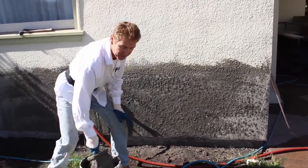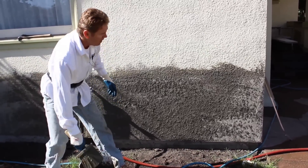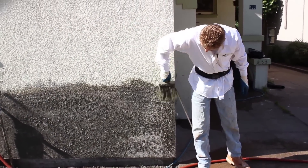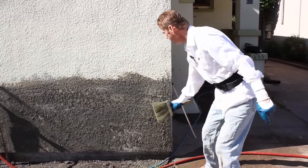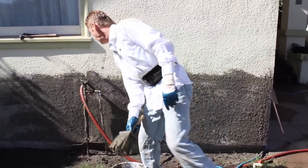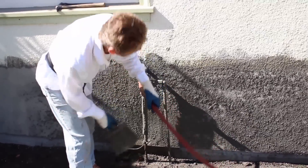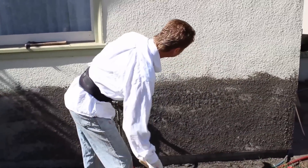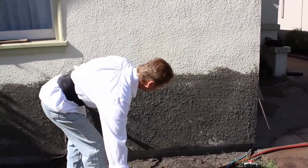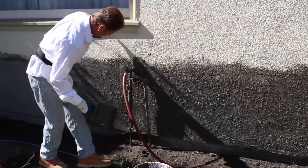You notice it comes off in a little pattern — square patterns, or any pattern I want. I'm using the whole flat surface of the brush, which is about eight inches, so eight by four. Now here on the corner, I'm going to use that same eight inches and just dab it a little bit — because I don't want mud all over the other side, but you still get a little. When painted, this finish will match. After 30 years I know what a texture will look like before it's painted, so when I saw this I said, 'That's not going to match.'